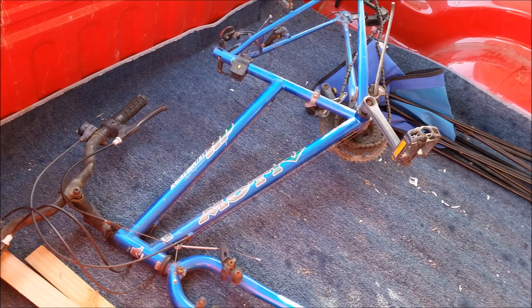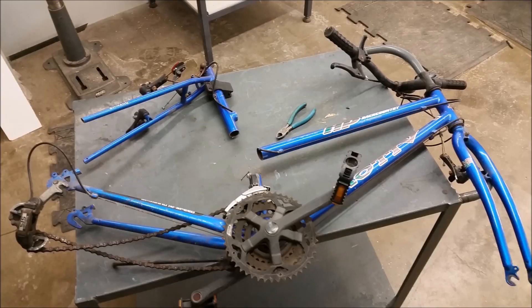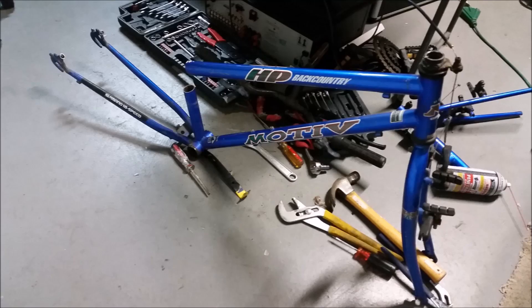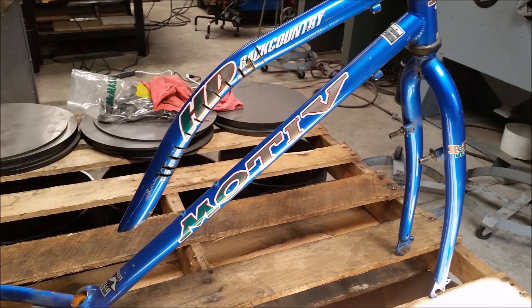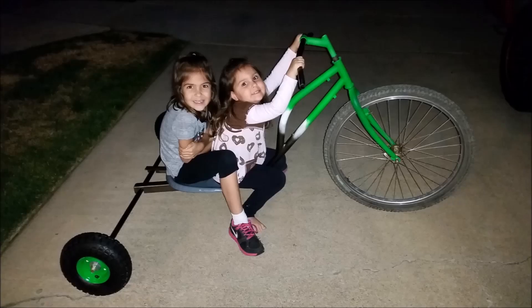I thought to myself, realistically these are just kind of like modified bikes, and if you could do a little welding and a little fabrication it really shouldn't be that hard to build one. So I started doing a little research and found a few guys on YouTube building their own for relatively cheap using old bike frames. I thought, hey, I can do this — so that's exactly what I did. I found a really cheap mountain bike frame on Craigslist and started fabricating. I used a female mountain bike frame because that top crossbar has a slight downward angle, and I needed that because the bar comes back around and ties into the tube giving a little extra rigidity. You can see as the fabrication goes along it's starting to take shape and look like a trike.